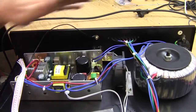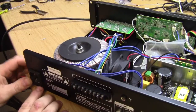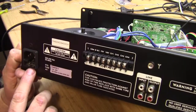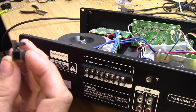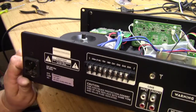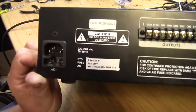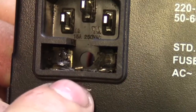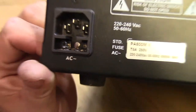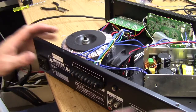So I thought, let me trace the power from the back. This is one of those IEC inputs with a fuse holder. I slid the little fuse holder out and heard a crunch the whole time I was pulling it out. If you look inside, that fuse has been totally destroyed — the little end caps are still in there. That's supposed to be a 5 amp 250 volt fuse according to the label, and the fuse on the board is also a 5 amp fuse. So much for coordination.